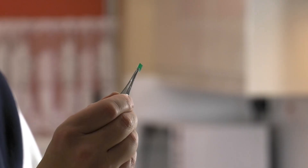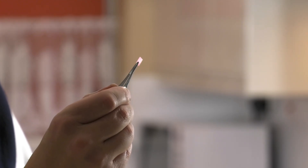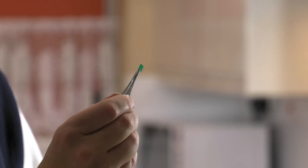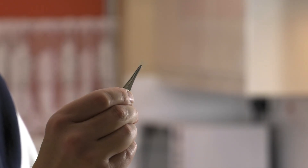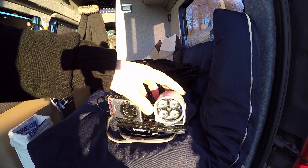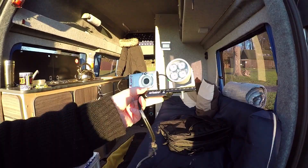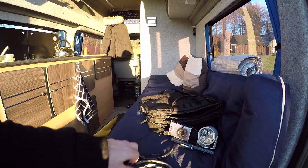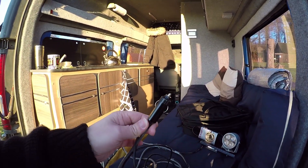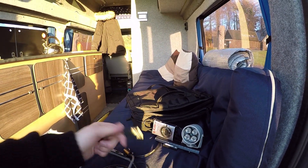The camera is back together again and it all seems to be working quite well. That is the piece I removed — this tiny little infrared filter that was just in front of the main sensor. Because I've now removed that, the sensor is picking up infrared light. This is now an infrared camera which will see in the dark as long as you've got some sort of infrared illumination. I got an infrared illuminator and this whole rig can sit on a tripod, all run off 12 volts — the illuminator and the camera both powered from a 12-volt source via USB.